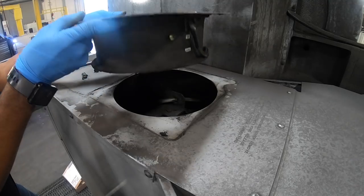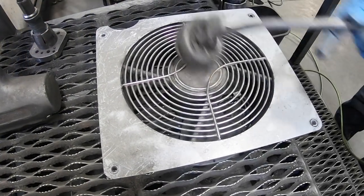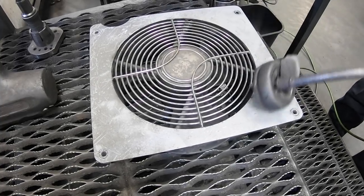If the fan is not turning, check that the wiring and connectors are properly seated. Next, do a visual inspection. Make sure that there are no coolant leaks evident, since coolant on the fan can cause chips and dust to collect on the blades. If there are signs of significant buildup, try and determine the source of the contamination. But no matter what the cause, it's time to remove and clean the fan.